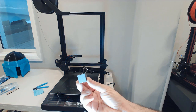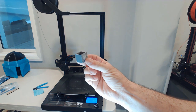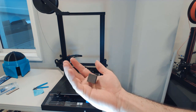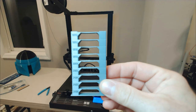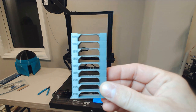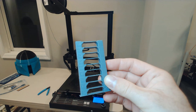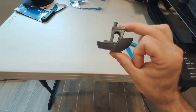The first print I do after all this is a flow test. I do a two-wall cube — it came out perfectly at 0.8 on all sides, so I knew my flow was dialed in. There was some pitting in the cube though, so temperature was the next thing to check. I did a temperature tower and sure enough I was about 20 degrees too high — I was printing at 205 but this filament really wanted 185. After temperature was sorted I did a Benchy to check everything was in order, and it came out very, very nicely.